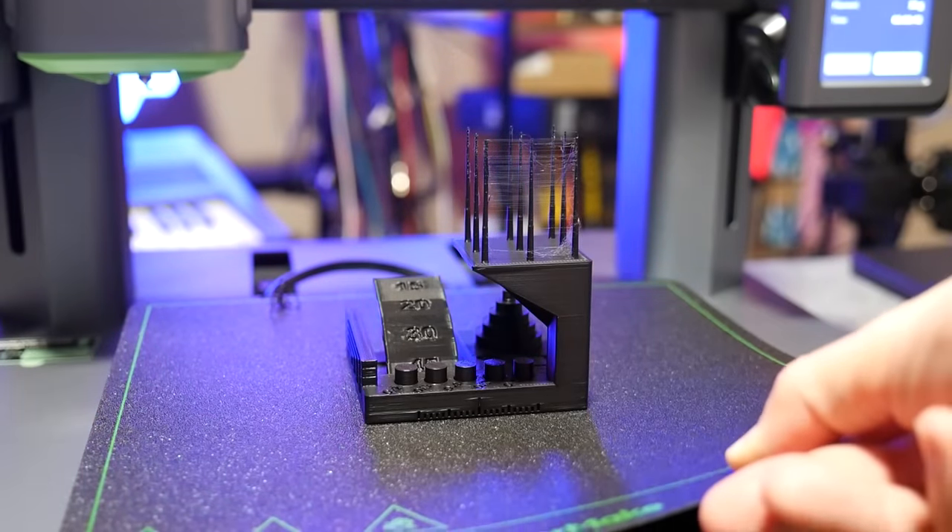And of course I had to finish up with the Torture Lattice Cube, which completed — I'm very happy with that, because so many printers lately have not been able to print this file. It's hard to see with their white PLA, and the bottom could be better in terms of cooling, but it still didn't fail. None of the arms broke, and as it got to the top the print finish actually improved quite a bit. Cooling could be better, but the fact this finished is a really good sign for delicate prints. Like this screw here, which was printed in PrusaSlicer with my own profile with snug supports placed exactly where I needed them — they broke away beautifully, and the rest was printed without support material. A pretty clean result for such a delicate model.